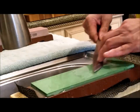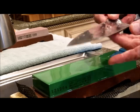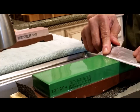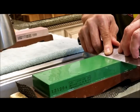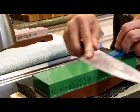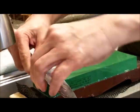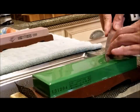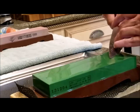Now I'm going to switch to the 1000 grit here — same idea. Feel the burr on both sides. The burr is on the other side now, so I'll place it here, put my thumb on the heel, hold it down, make sure there's a 15-degree angle, and then move it back and forth. Make sure the angle is good. Feel for the burr — a little bit now. After a few passes on the 1000, I want to remove the burr before I move to the 3000. So we'll finish the 1000 with some gentle strokes.